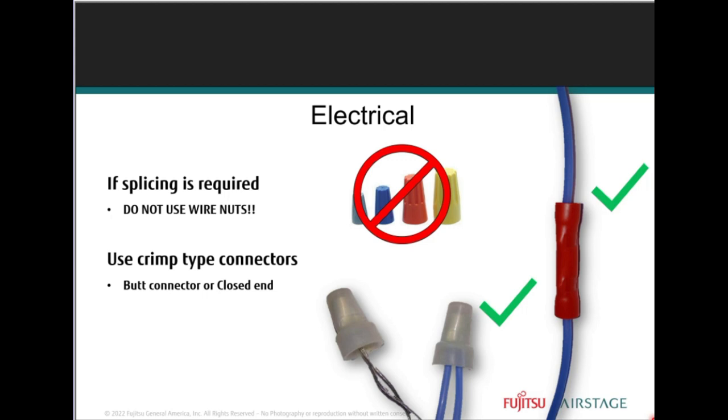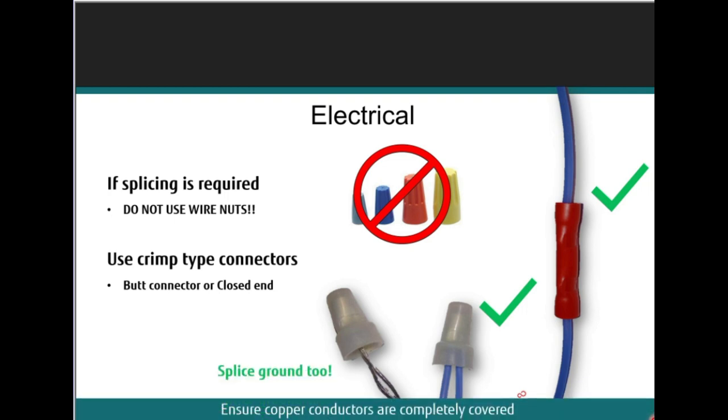These right here, definitely. Absolutely, because you're not twisting the wires underneath. They don't have twisting capabilities. And don't twist the wire. Just put them together, put the cap over, crimp. Here, it's basically a coupling. Strip both ends of the wire, insert the wire into here, crimp. Insert this wire into here, crimp. Done. And then tape it if you'd like to tape it, so it stays together. Right?